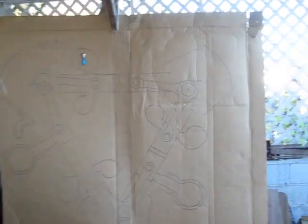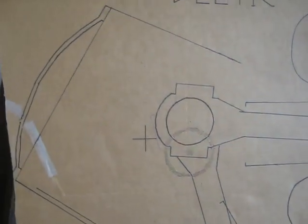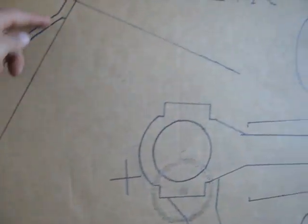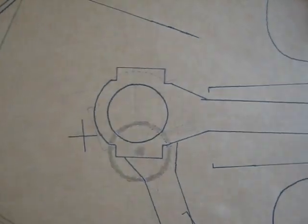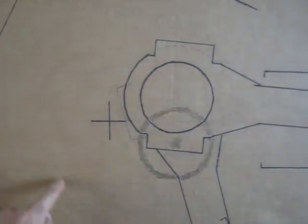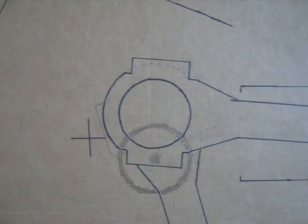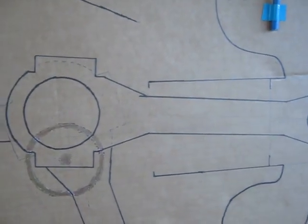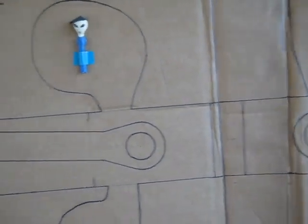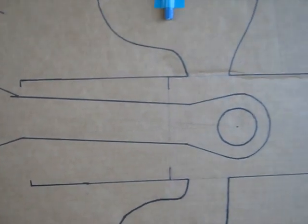I'm hoping it shows up on the video. Getting closer, this crankshaft cover here is 14 inches, and you can see the big connecting rods. There's the center of the crankshaft there, with connecting rods following the circle. It's a seven and a quarter inch circle times two, which gives a fourteen and a half inch effective stroke between the two crankshafts, and five and one eighth inch cylinder bore.